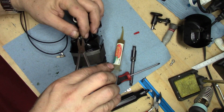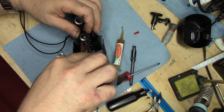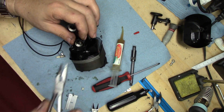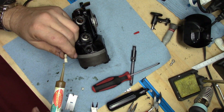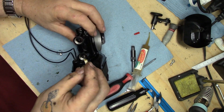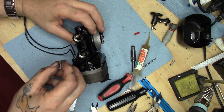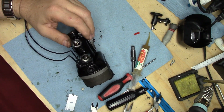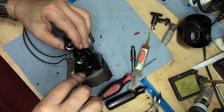Using a pair of needle nose pliers, gently squeeze the holder together and then press it down and in place. You've got to be very gentle when doing this — if you are rough with it you will break the little metal retainer, and then you're screwed. You either have to fabricate one or try to repair what you've damaged — neither of which is a fun alternative. I know, I've done both.